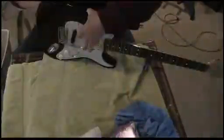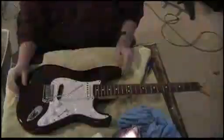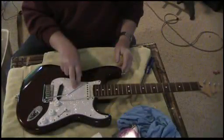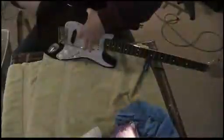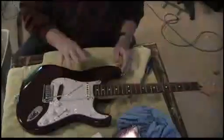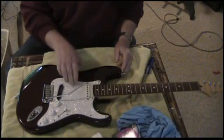See them very well. That's kind of what I got there. In the back, I got the same pearl as I do the front, and they put strap locks on it. But when I got this guitar, it had no shielding in it. So any type of radio noise, the pickups would just sound like you're getting radio stations all the time. So I had to reshield the cavity in this.